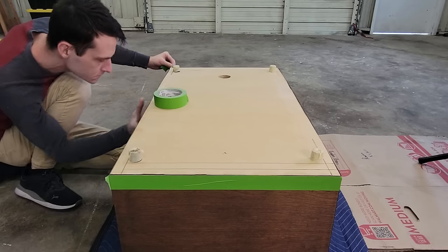So to power this driver, I'm going to be using my Crown XLS 2002. This is a pro style amplifier. It can drive very low impedance drivers like we often see in car audio. In stereo mode, it is stable down to 2 ohms and 4 ohms bridged. I'll use the bandpass setting to create a high pass at 30 Hz and a low pass around 90 Hz to start.